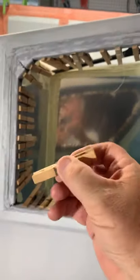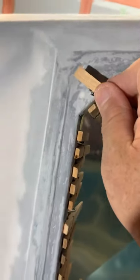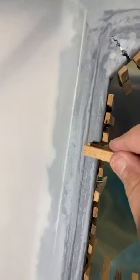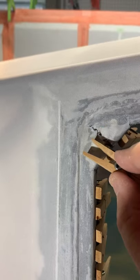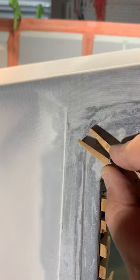Once you've done that, you're going to glue in this recessed area. One thing that works good — if you're using the chip brushes, use the wooden handle, or a clothespin works great. Just as you've glued it, glue a small section and push it down to make it stay down in that recessed area. If it's a curved area and it just keeps wanting to pop up, then go back and cut another piece, cut it all the way back up into here.